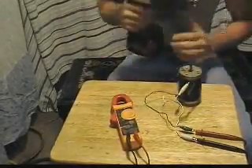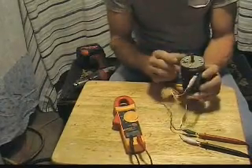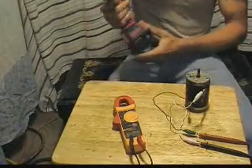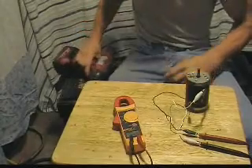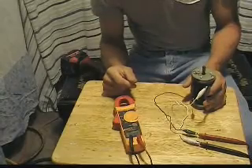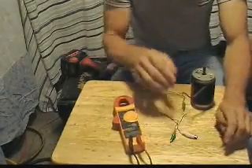What's the point of this? It's a little simple science project. What I want to do in my next few videos is build a prop for this, mount it on a stand, and give it some wind power. My drill — just for giggles — is an old Milwaukee hammer drill. I don't think it's much over 1,400 RPM. With some simple gearing or pulley styles, we're going to make this motor put out more than 8.8 volts. I think the battery that powered the motor on the scooter was like 24 volts, so it's a heavy duty motor — it'll handle it.